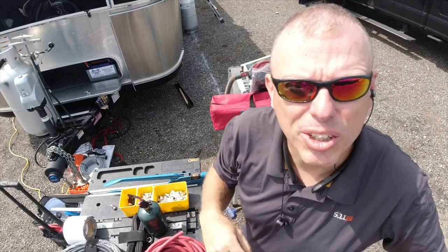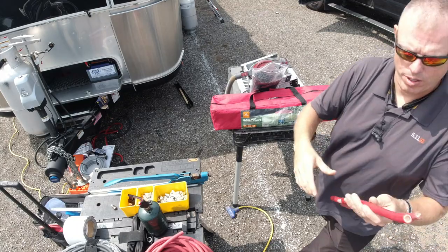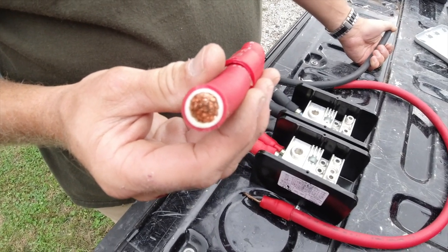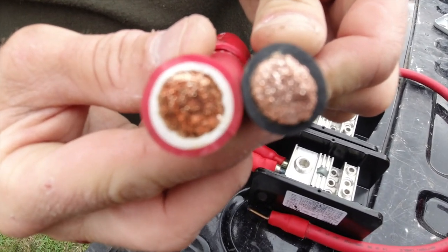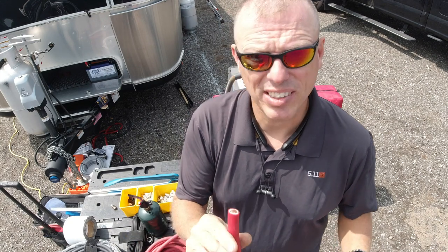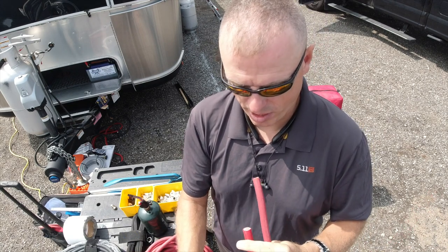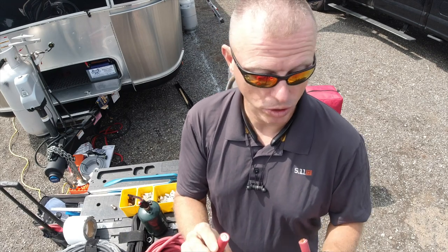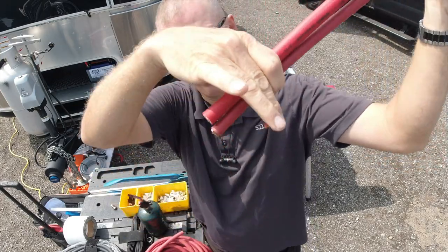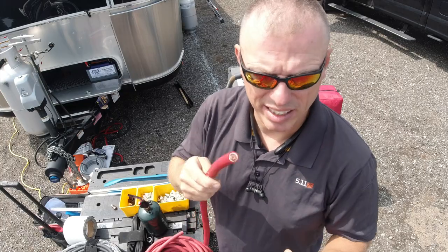After some testing, we've concluded the wire is QC battery cable, 2-aught gauge SAE, stamped 'certified full 2-aught AWG copper stranded, minimum 0.422 pounds copper per foot.' I've never seen anybody put that on a piece of wire unless they're lying. I don't know exactly what's in this wire — if it's tin or some sort of copper. It definitely looks like copper, but it is not as heavy as the reference piece, even with the double jacket, and they're very close to the same length.